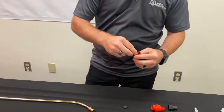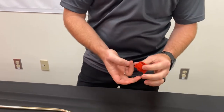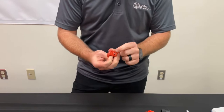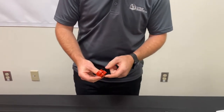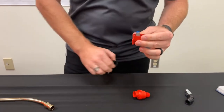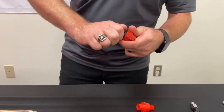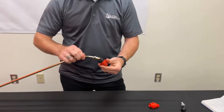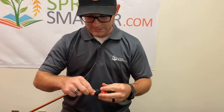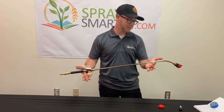We also sell this in a 24, 30, 36, and 48-inch. I'll go ahead and assemble this here. You get your tip — that's a separate part number — into your special cap specifically for the XR. In this case I have an XR, and then an option would be the tip strainer. Then your T-Jet quarter-turn adapter would just quarter-turn on there, and this is 11/16 thread and will thread onto the end of the brass wand — so this would be ready to start spraying.